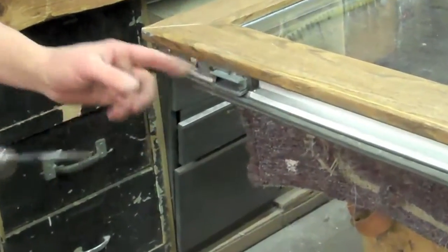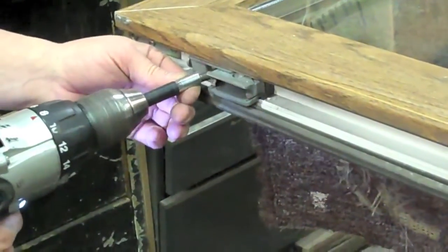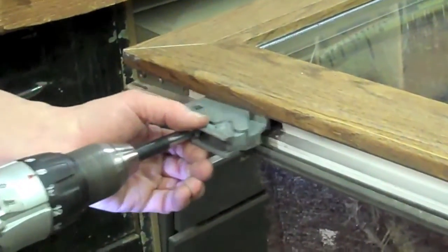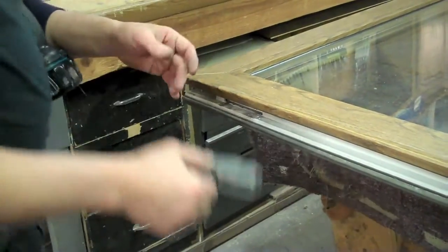Tug the trolley of the roller down so you can access the removal screw. Now you can unscrew the roller cartridge and pull it out of the door. This is a tank tread style roller. The little beads inside tend to break or fall out, and they don't make tank tread rollers anymore.